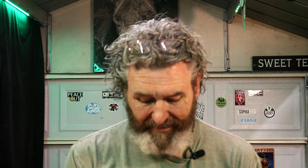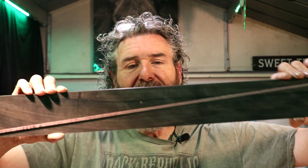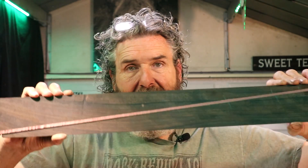I have not changed woods, but I have decided to do something a little funky. I messaged Scott from Bonehead Guitars a little earlier today to find out if he was cool if I borrowed a technique I saw him do not too long ago. He tapered his fretboard and put a piece of accent wood in that taper like this. This is that ebony fretboard. I've ran it through the planer. I've jointed all four sides of it. I've got a piece of Purple Heart in this ebony fretboard. I am going to border this with some light veneer. Pretty much like he did. I think he used blood wood.